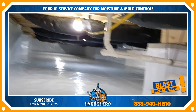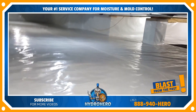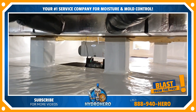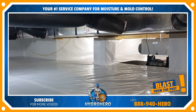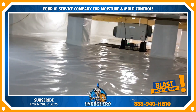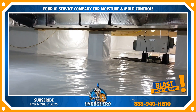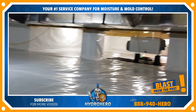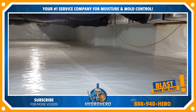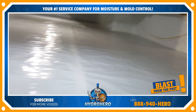This particular customer's installation was already still good, so rather than have him spend thousands of dollars ripping out his insulation and putting rigid foam board on his walls or spraying it with expanded foam — which really has no energy benefit over being in the floor — it's all about being sealed airtight. That'll lock the moisture out and keep the thermal temperature regulated. Studies done by Advanced Energy out of North Carolina proved beyond a doubt that whether you insulate the floors with batt insulation or insulate the walls, there's no real energy savings difference. It's all about how well you seal the crawl space.